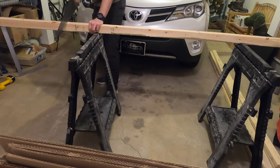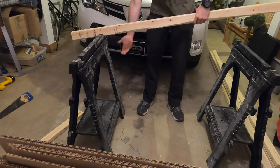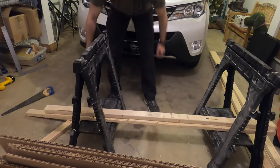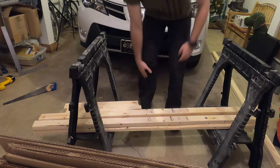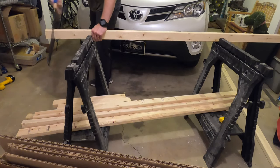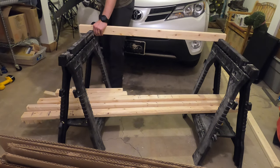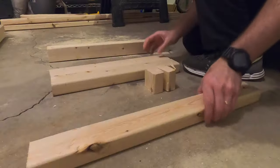After you finish measuring, go ahead and cut the required wood. You only need two 24-inch lengths, two 18-and-a-half-inch lengths, two two-and-a-half-inch lengths, and then the six-foot lengths which you can see there. I was making two stands, so if you see double the amount of cuts, that's why. You can take five planks and make everything you need for two target stands.